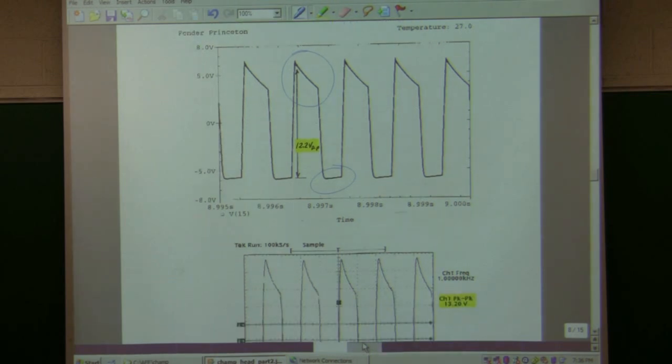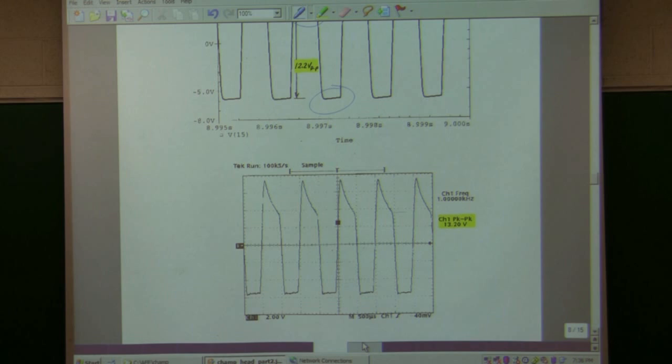Then I started thinking about the sound effects. And we mentioned, people told me when they play guitar that the tubes respond when they overdrive them. But I wasn't sure, I didn't think that was really modeled in the tube, but then I thought about this case here. So I ran the simulation. I tried to do it in lab, and I watched the power supply changing a little bit, but I didn't get the setup that I wanted. So I went back and did simulation. I took this waveform, and I delayed it for about 8 seconds, and then I hit the amplifier with it. And all of a sudden, I saw the output shoot up, and a second later, or almost 2 seconds later, become this wave shape.